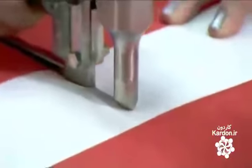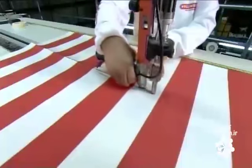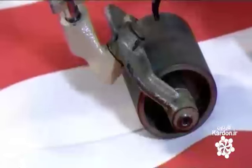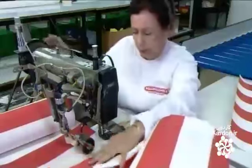Production begins with the fabric, which comes in a range of weather-resistant synthetics. The seamstress cuts out patterns from thick acrylic material and sews the pieces together. Here she works on the awning's front valance. A roller keeps the fabric correctly aligned and stops it from bunching up as she sews.